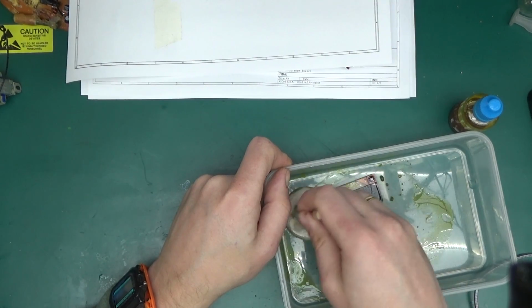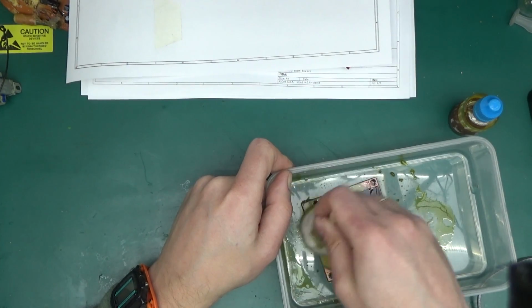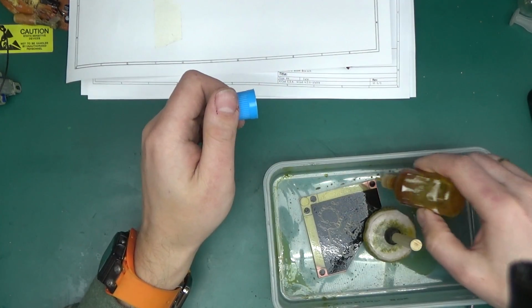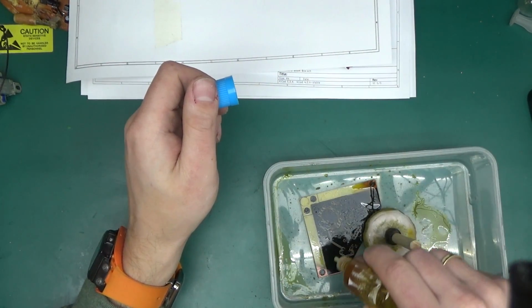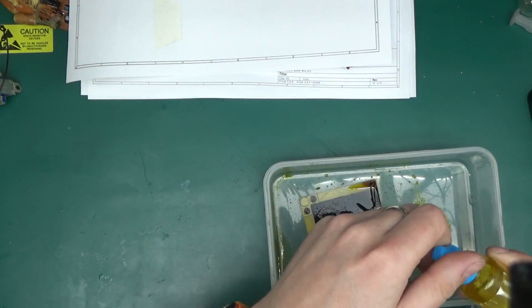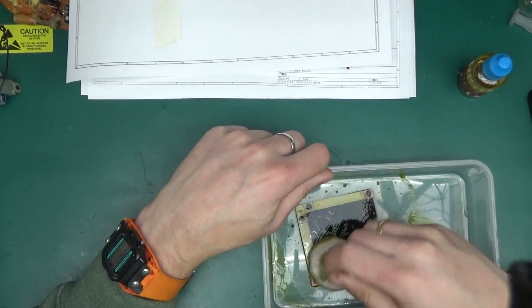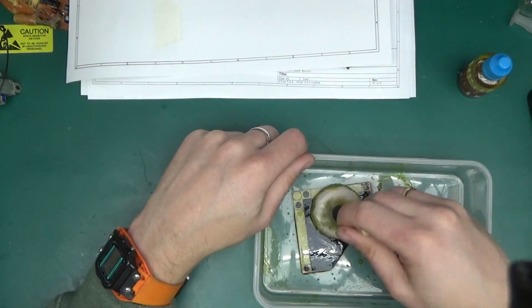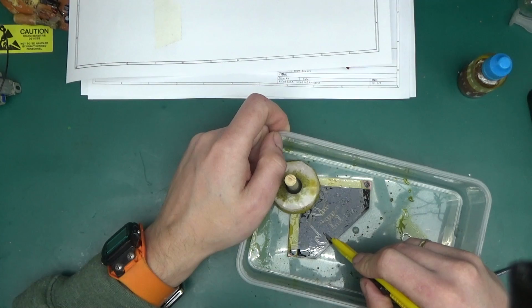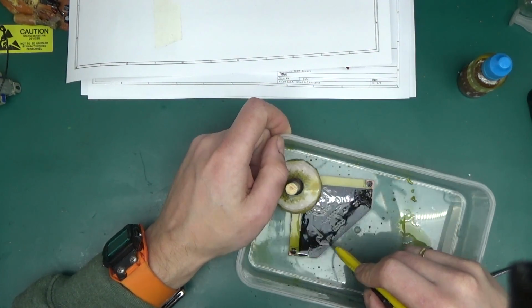But I can see the logic behind this method. It does accelerate etching. I guess the key is to have the right amount of ferric chloride for the amount of copper that you want to etch. I can see I might have a small problem on the USB connector, so while I can, I'll try to fix the problem.